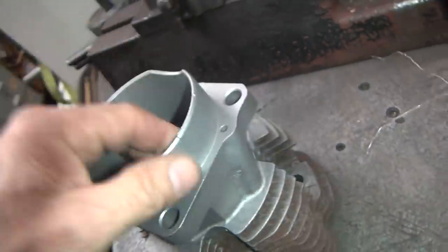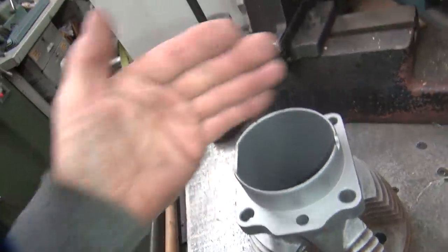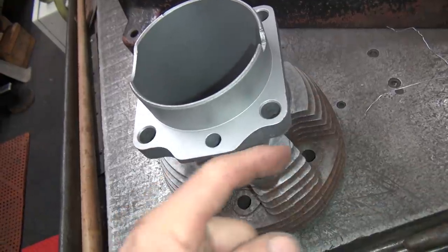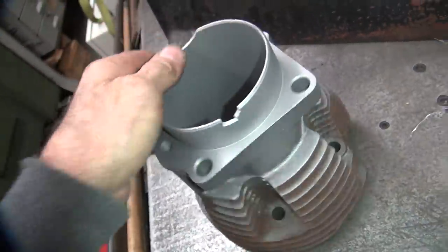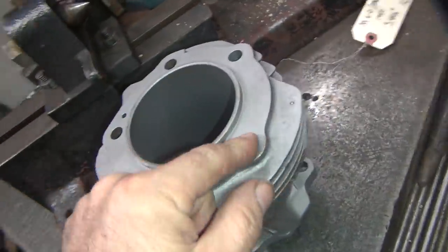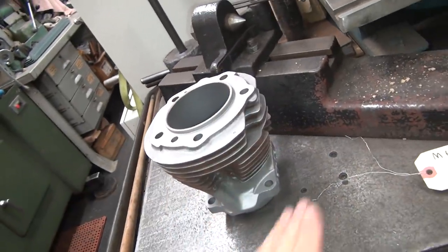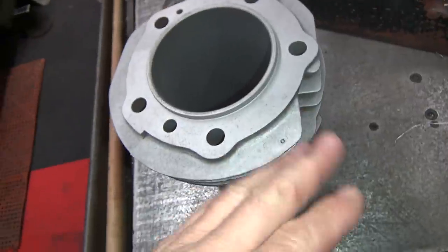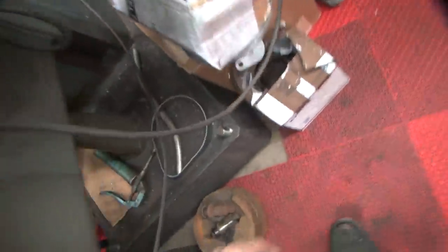You can run it with that break in there, but it's not exactly what you want to see. The advantage is it's on the side — the cylinder does not wear there because thrusting is front to back. This is the front cylinder because the rear cylinder has a large area that goes around. The other way to tell is this is the oil feed hole for the panhead cylinder, and this is the return hole. The feed is on the right, returns on the left. The window of the cylinder is for the V-angle. Panhead cylinders are sculptured out like this — so are knuckleheads. Shovelheads are rounded all the way around. That's a Sportster cylinder — they're four-bolt.